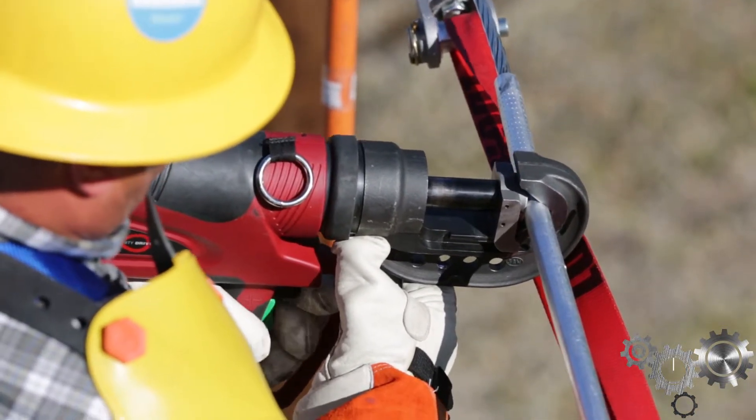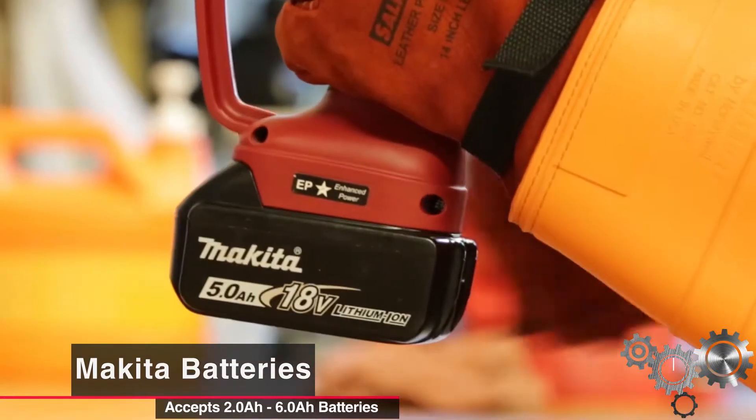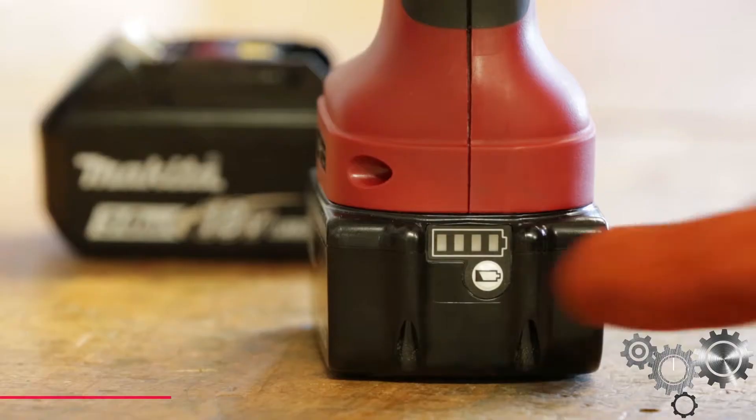The range-taking capabilities on this in the C&I market on your standard copper and aluminum lugs is actually from number 4 up to 1,000. So again, one tool — you can get a lot of different size crimps off of this. It's just a great tool that you're going to want to have in your truck for any type of application.